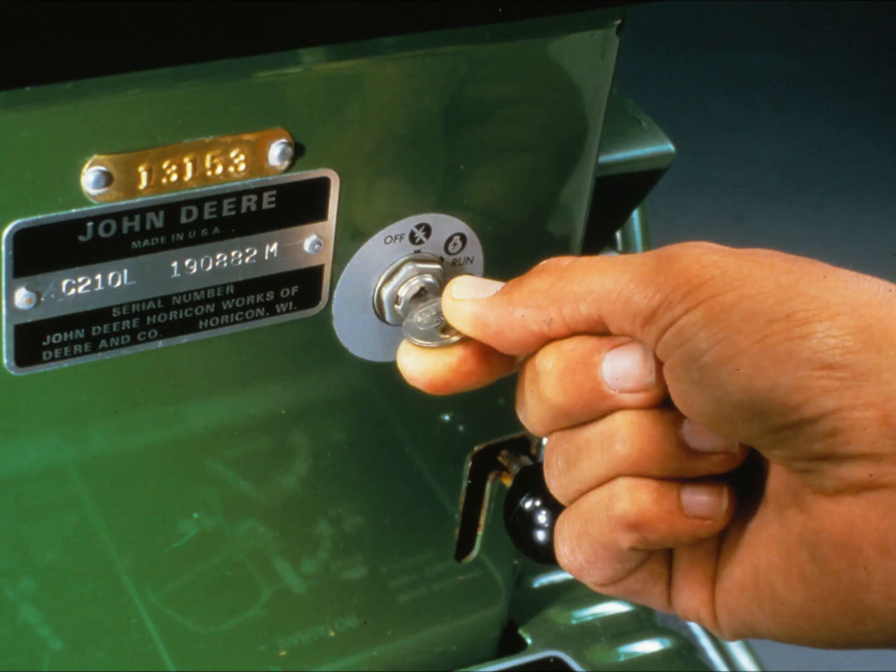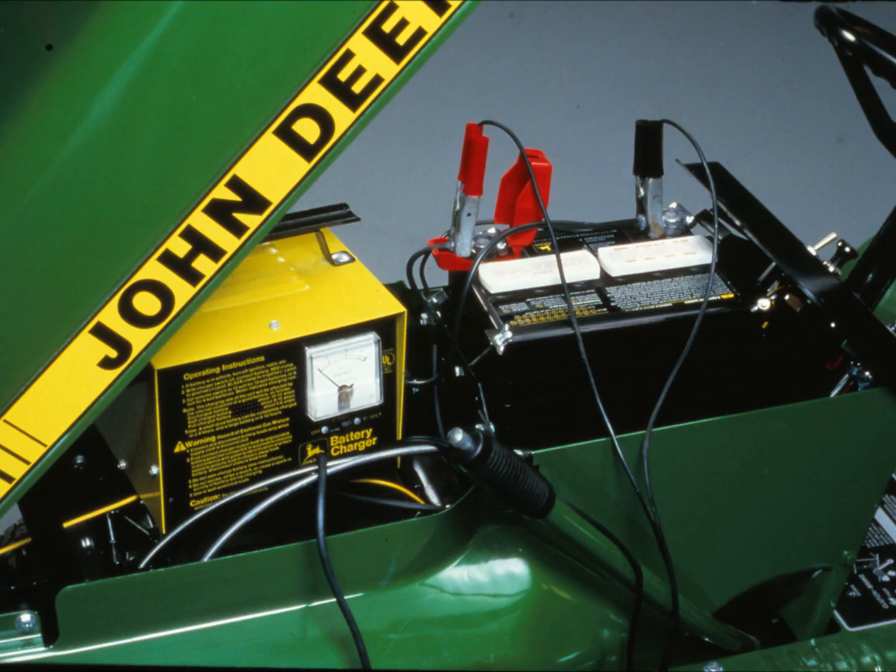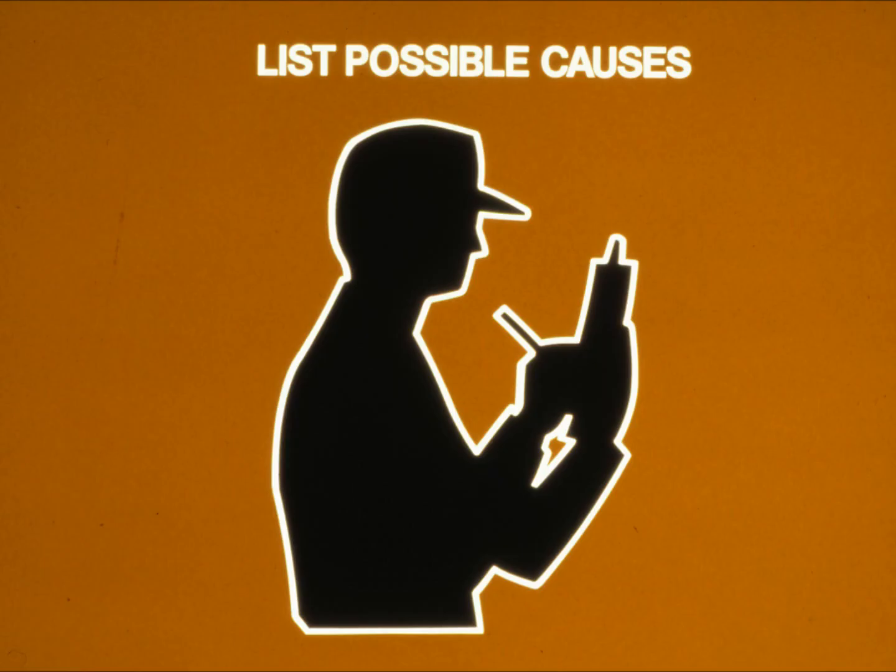Continue with the seven-step method — try running the machine yourself. Crank the engine: does it turn over slowly or not at all? If the engine turned over slowly or wouldn't turn over, try charging the battery with a battery charger to find out if the battery will take and hold a charge. Keep in mind that mechanical functions like a faulty starter could also cause this symptom.